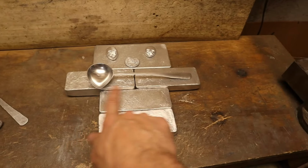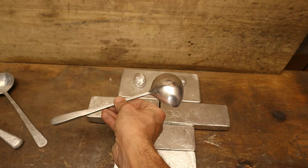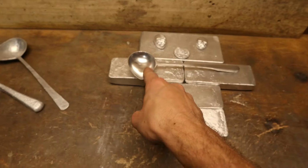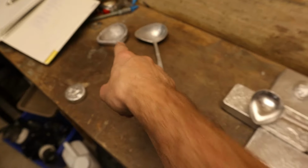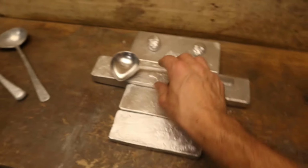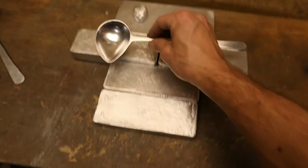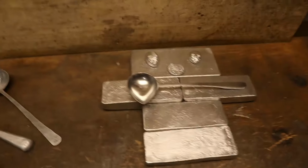And it's mostly on the bottom, which technically, when I was pouring it, would be whatever was touching the sand. Anyways, this was the Petrobond sand, the ugly ones. That was the green sand. So also maybe some gases, I'm not sure. But first one, not really too worried about it. 600 grit, a little bit of Flitz, kind of made it look nice. I'll try and get you some close-up shots to show you the pitting.